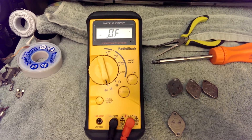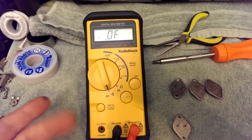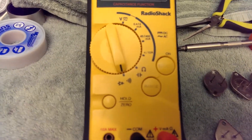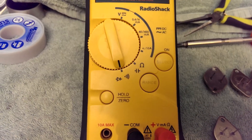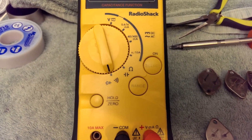Fortunately, for just a quick and dirty check of transistor operation, you don't need a fancy multimeter. You need just any cheap multimeter with a diode check function. You can technically use a resistance function as well, but I like using the diode check method — I think it works a little better.